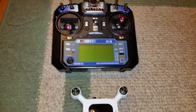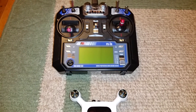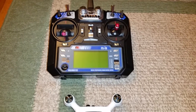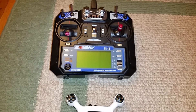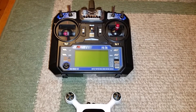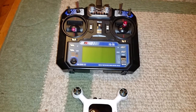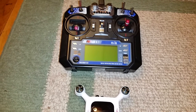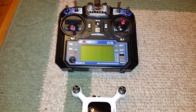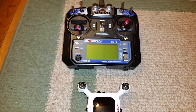If you want 10 channels and don't want to do the firmware hack and mess with iBus, I believe Flysky has released an updated version of this transmitter — I think it's the i6X or something to that effect — that has PPM working to 8 channels, and S-Bus and iBus working with 10 channels. Eight is really all you need, but the firmware hack gives you 10, so why not?